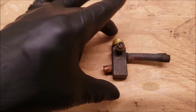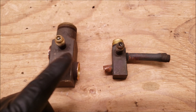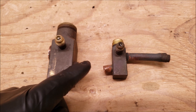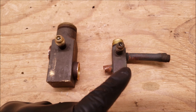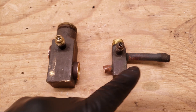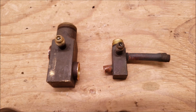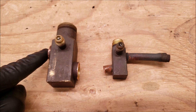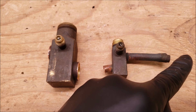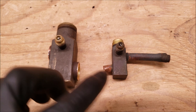This is the vapor line service valve. This is the liquid line service valve. This tube on this two-position service valve is connected to the compressor — or it can go to the accumulator then the compressor. This one connects to the condenser coil. These are your brazed connections. This gets connected to the line set, and this gets connected to the line set going to the evaporator coil — specifically to the metering device right in front of the evaporator coil.